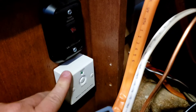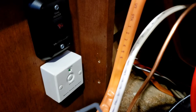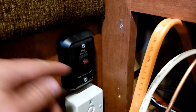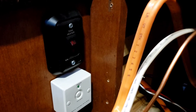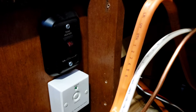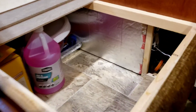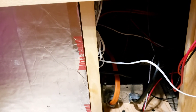This is the switch that controls the inverter — just a simple on/off. Right now it won't do anything because the inverter isn't hooked up yet, but this green LED will illuminate when the inverter is turned on. Above this is an old project: the tank heater for the freshwater tank. It's a simple 12-volt heating pad glued to the bottom of the tank with a built-in thermostat to sense temperature. If it goes below a certain temperature it turns on the heating elements, and when it comes back up to a reasonable temperature it turns them off. The generator box has foam insulation around it, accessed through a cabinet underneath a seat in the back — getting in there to connect wiring requires folding myself in half.